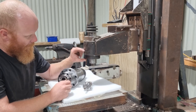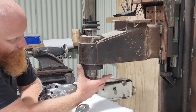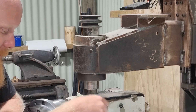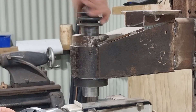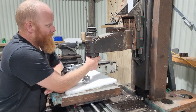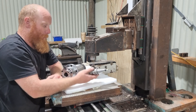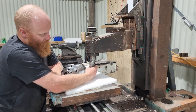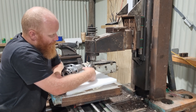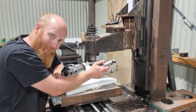This spindle here I made from scrap parts I had lying around and it's just got normal roller bearings in it — not really much good for axial load or anything like that. As you can see, it's not very free; the bearings are a bit tight. It's just not an ideal situation for a CNC spindle. It was machined on the lathe over here so it's not very accurate, but it got me a start. Here's some footage of it actually machining parts.